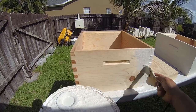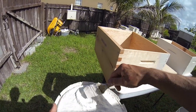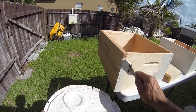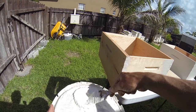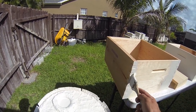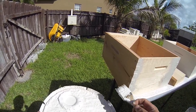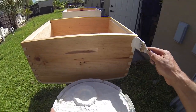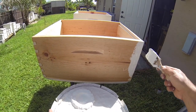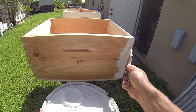This is more of an off-white. What I do is give it a good coat on these edges here — on the ends of the boards, you really want to seal these ends up so water doesn't soak up through the grain. I give that multiple coats and I do all the corners first. You can see it's just really thick — this is not supposed to be a pretty job.